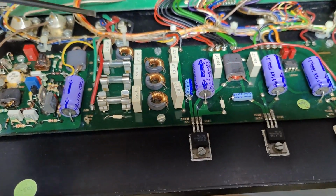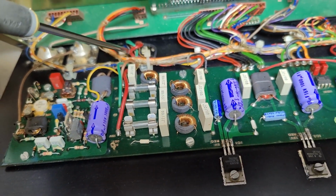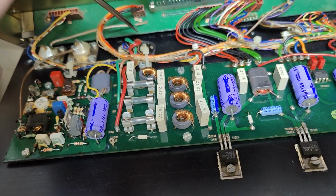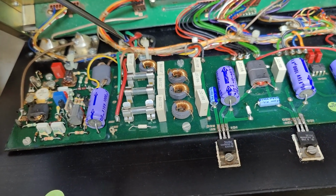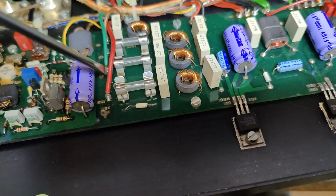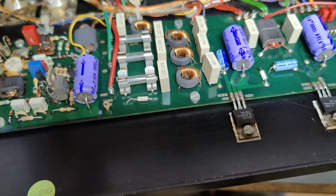So there is a DB15 connector here. And this one is the interconnect to the transmitter module. And not only is it power, so we got a ground and 3 different voltages, 15 and 9 and 9. It actually says here on the circuit board 9, 9 and 15. But in the manual, it's all wrong. This is 5 volts and all sorts of stuff that is completely wrong.